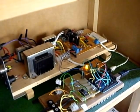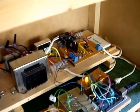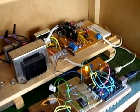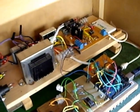If I were to put full power on, that would take more power than the PV panels are currently able to do. We should lose full power — all power should be lost to the immersion. So no power's going to the immersion. But I've simply arranged that the onboard LED on pin 13 flashes every measurement cycle — it just toggles. So if there's no power available I have a positive indication that that's what's happening.